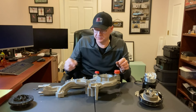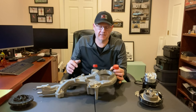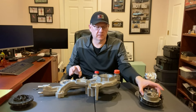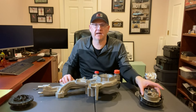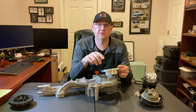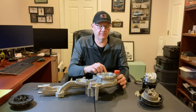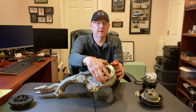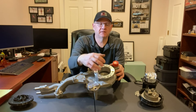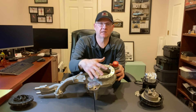We're using the factory embossed gasket for sealing the adapter ring to the pump housing. This housing has a dowel pin locator for the stock bearing housing, which reacts torque on the bearing unit. I have a receiver hole for that dowel pin to keep the adapter ring clocked correctly in the housing. It also aids assembly under the hood — with the pilot fit and the pin, all bolt holes line up so you can easily assemble and disassemble.